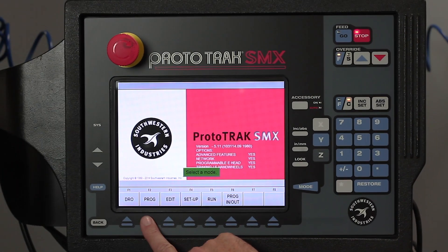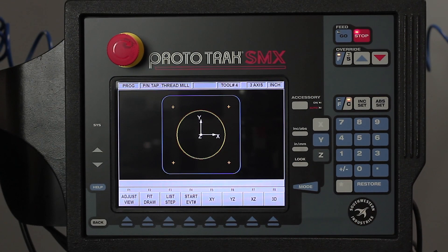If you look at the part I have in here, I'm going to go to program mode and push look. You'll see what I've already done: I've cut the outside of the part putting a radius on the corners, cut a circle out of the middle which we're going to thread in a minute, and drilled all the holes — that'll help keep the video a little shorter.